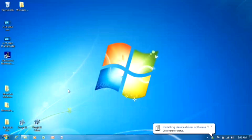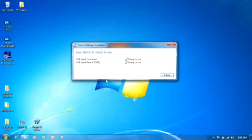You'll see now that we're getting a window dialog box that says installing the device driver software. Click here for details and status. We're going to do that, and it says here that our device is ready to use, serial converter, USB serial port, and so on. You may get a dialog box that says it's searching Windows Update or searching Windows. You should have it skip that because it's actually installed on your computer. There's no reason to go to Windows Update. So now that we have it ready to use, we're going to close this.